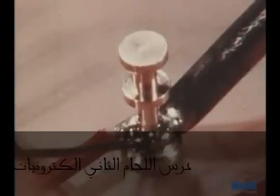Here is step number two: a solder bridge is made to increase the thermal linkage between tip and work. Step number three: solder is applied on the opposite side from the iron — it's painted on and then removed while the iron's still there. Step four: the iron is withdrawn with a wiping motion.